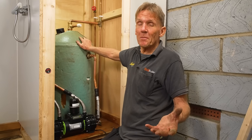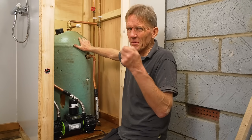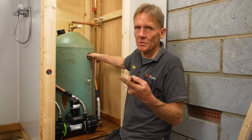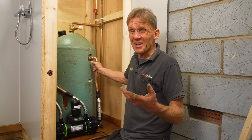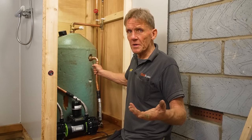So that's the Essex flange fitted, and the most difficult part for me was getting that little hook back out. I have known people just chuck it in there and forget it - you shouldn't do that. I did use a press fit fitting here; the only reason is because the only 22mm fittings I've got left on the van are solder elbows, and I didn't want to solder because that means flux in there that I'd have to clean out. So quick and easy - press fit fitting. I hope you found that interesting. If you've got any comments or questions put them in the comments below the video. I'm Roger Bisbee - come back and see you soon, we're going to be having more plumbing fun.